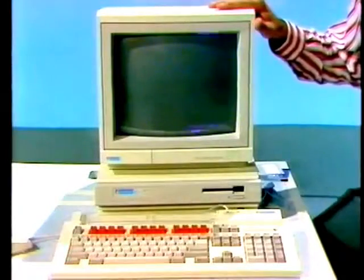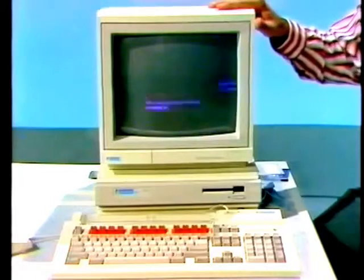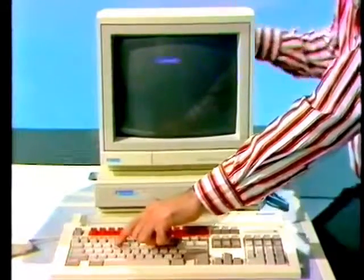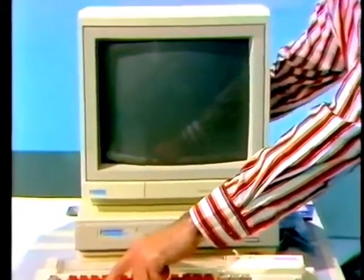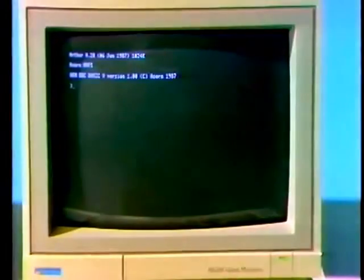For example, have a look at this. Well, the first thing you might do is start fiddling with the monitor. It obviously looks like a monitor fault, but it's not. In fact, the solution is as easy as this. I press the R button, and I switch off and on again. Quick pause, and there's a perfect picture. All I was doing was reconfiguring the system. This machine is capable of being configured in a way that suits the user.